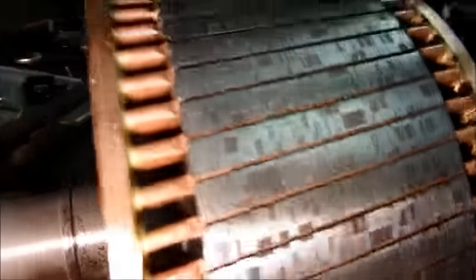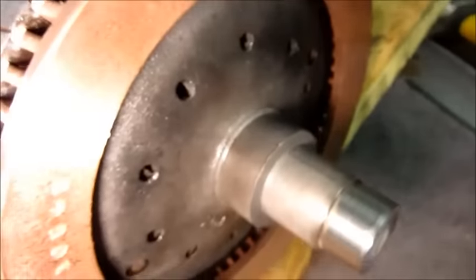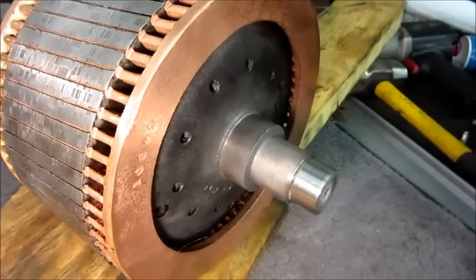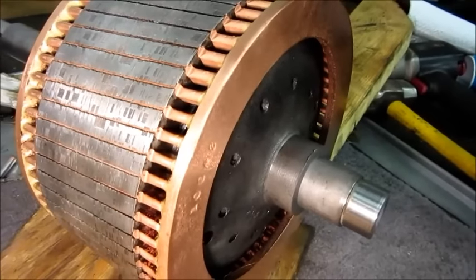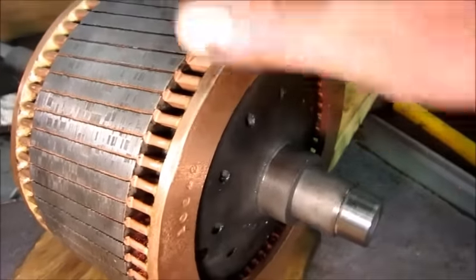This part is cast iron, these are steel laminations, and what I don't understand about it is there appears to be lead put inside there — not sure if that's for balancing or if that's how it was actually bonded together. But that thing is heavy. I would wager it probably weighs 75, maybe 100 pounds — it's shockingly heavy, almost heavier than solid iron. I don't know if ILG discovered a depleted uranium rotor worked pretty well back then, but it's got some serious heft to it. Got it all cleaned up and ready to go back in.